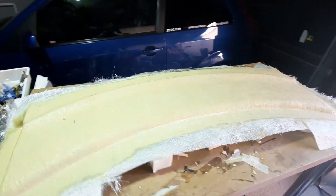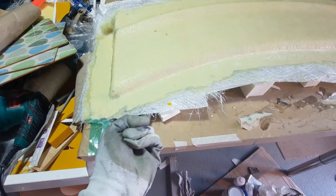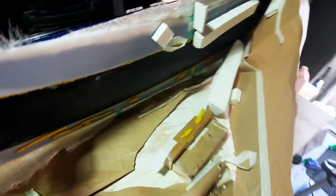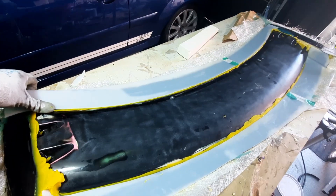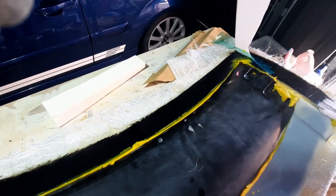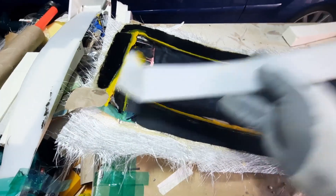Once that's cured, the challenge is to release it and pull it away from the table, and remove all of the mold flange supports and other pieces so you can get to the part. It looks like that's come away nicely — made a bit of a mess of my table ripping up all the paper, but hey, that's life. The mold release is doing its job very nicely, and that black perimeter you see around the part will effectively be the flange of the mold once the other side has been laid up onto it.